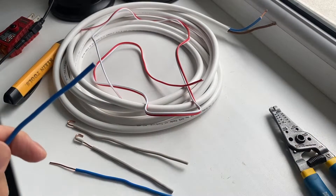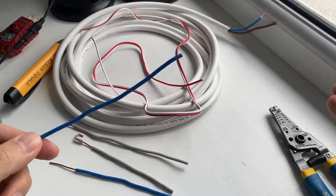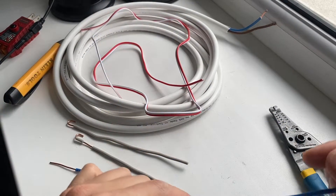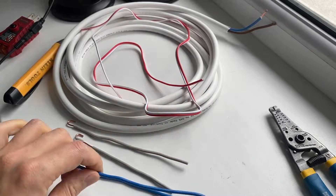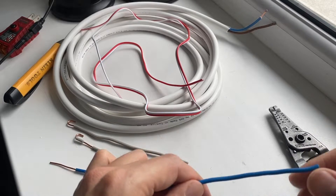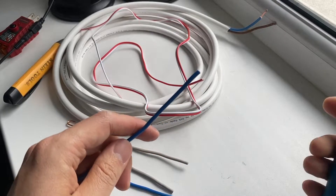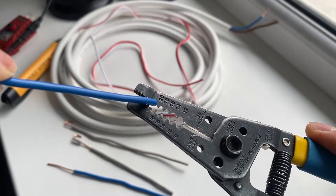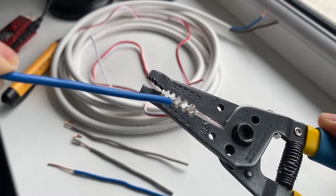The first method is very easy. Let's say you have to strip a wire — this is 14 gauge — make sure you know what gauge the wire is. Most US households, if you're stripping a wire for an outlet, will have either number 14 gauge in your bedroom, bathroom, or hallways, or number 12 in the bathroom and kitchen, which is a little bit thicker. The higher the number, the thinner the wire; the lower the number, the thicker the wire.